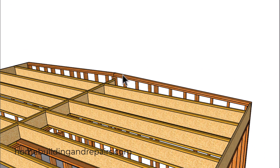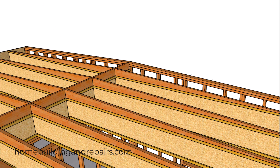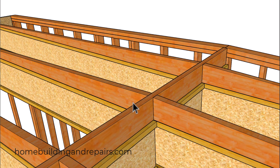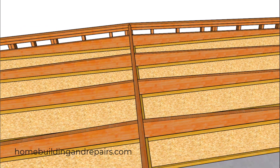Let's take a look at the upper view with the rake wall. To calculate the height of the rake wall, I went up five and a half inches to the center, because I ripped a 2x6 in half to get two roof rafters that were exactly the same — one on each side. We have the 2x6 here with blocks, and I went ahead and installed the blocking on this side even with one side. These shaped boards can be toenailed into the ceiling joist, or you could nail up from the bottom if the manufacturer allows.